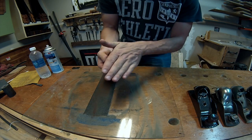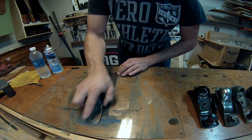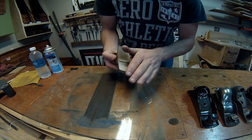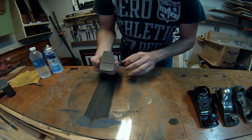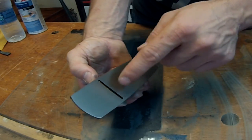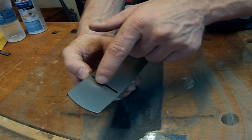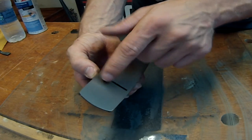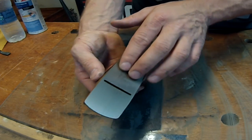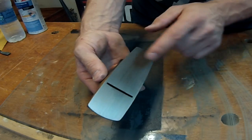Some of these are just like surface rust. Always make sure that you've got your blade recessed, so it's flat on the heel and toe. One of the main things you really have to look for is to make sure it's really flat right here on the heel, right here on the toe, and also right where the blade comes through. If these aren't flat, then you aren't going to get a nice cut. You need it flat right at the cutter, the toe, and the heel.